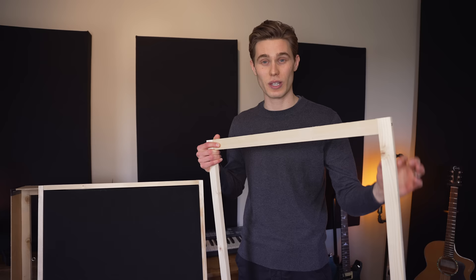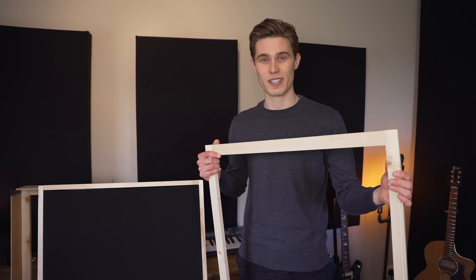Now that I've given you an overview, let's get into all the details. I've added chapter markers and timestamps to this video so you can follow along one section at a time. The first step is to make a very strong wooden frame. Many designs start with large wide planks of square planed timber, but unfortunately this leads to quite a flexible panel. It's actually much easier to create a stronger frame by using thinner pieces of wood — and I know this is probably hard to believe, but if you lay up the panels right you create a frame that can take a huge amount of stress and strain and be very lightweight.